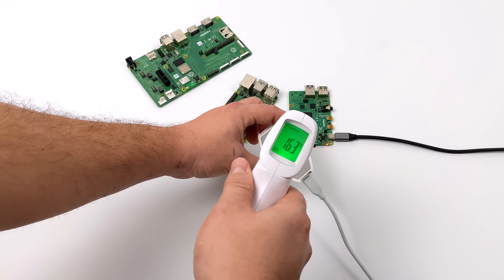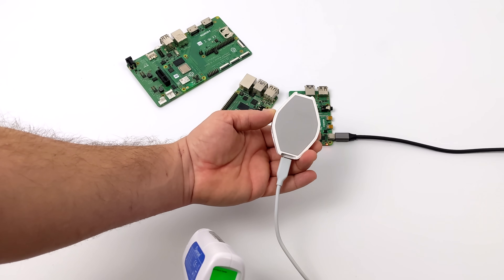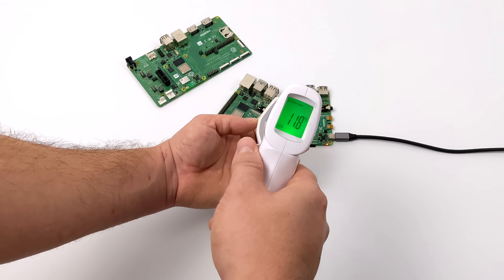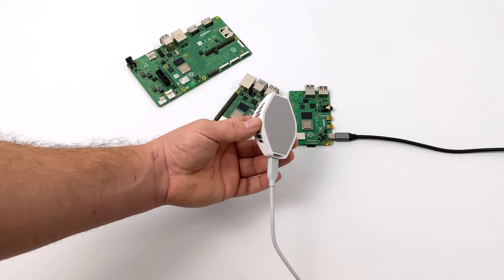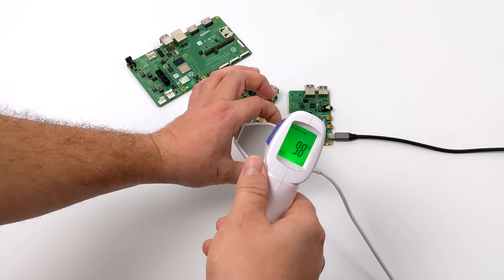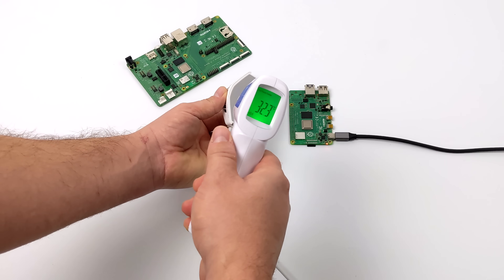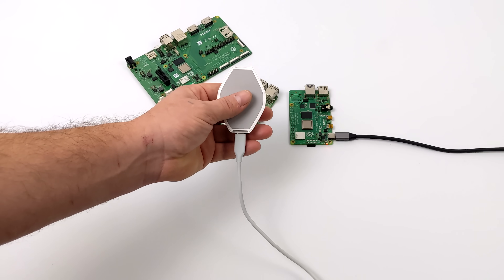If I give it a little while, it should go down even further. As you can see, it's consistently dropping and it is cold to the touch — we're at 12.7 degrees Celsius. A few more seconds: 11.8, then 10, and I have seen it go as low as 8.7 degrees Celsius. It's consistently dropping, much cooler than room temperature, much cooler than the Raspberry Pi CPU right now. This is a low wattage version rated at 5 watts, but I've seen it pull up to 8. If you had something more powerful, you could freeze this Raspberry Pi right out.